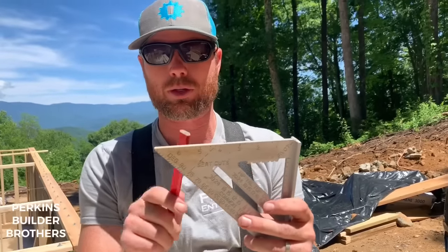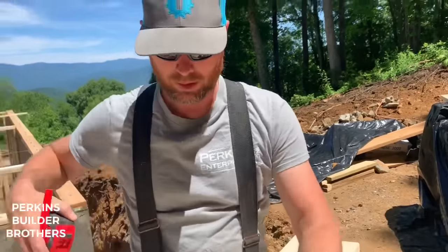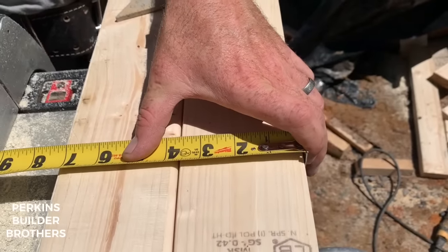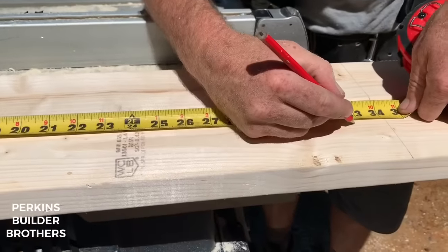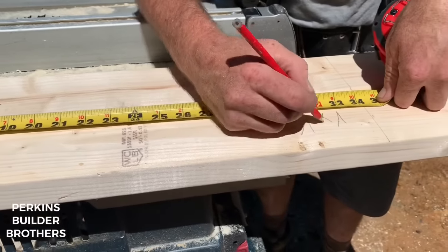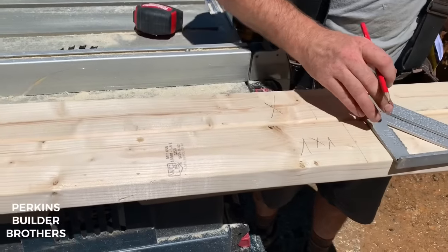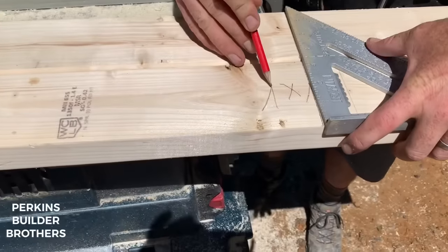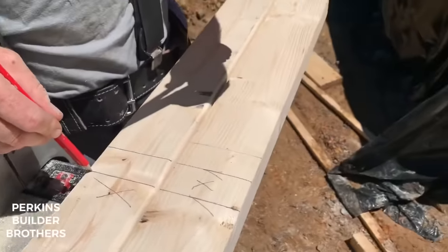It's also no accident that a speed square measures about seven inches across the top — in fact, a hair more, about seven and an eighth. That's because two-by-fours are three and a half inches wide, and across two of them is seven inches; if they're spaced out a little bit, seven and an eighth. So when you're doing your layout — say you're doing 16 on center — you're going to mark three-quarters either side of 16-inch increments. That's a stud. You want to make sure the ends of your plates are flush before you do that, then strike your lines all the way across with your seven-inch speed square.